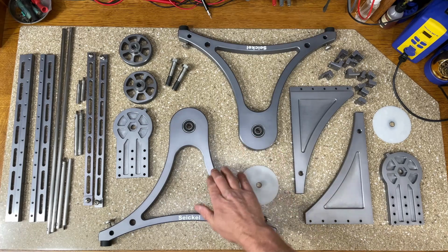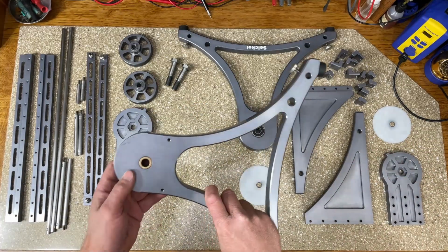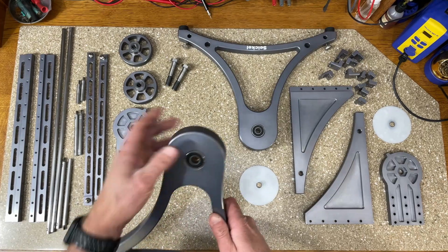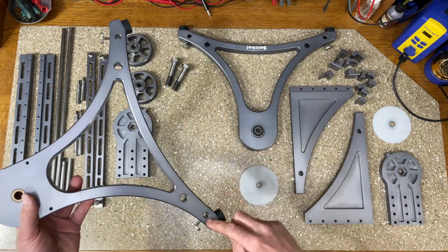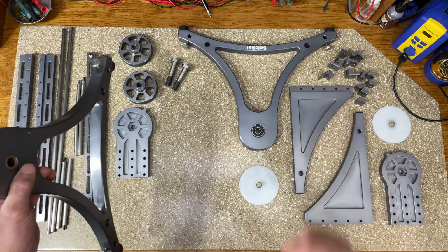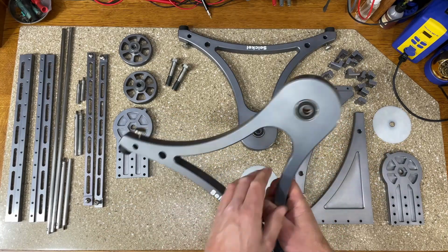So I have two uprights here, and those are what go alongside the chassis to hold it and allow it to rotate. On the inside here I have a plain sleeve bronze bearing, and on the outside there's a ball bearing. The ball bearing is important to the clutch action, and I'll go into that in a little while. I have thumb screws that go into these holes here, and these accept spreader rods that go across and connect the two uprights together to hold them a set distance. I also have nice rubber feet on here that are on threaded studs, and of course my vanity engraving there.